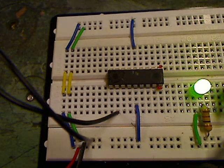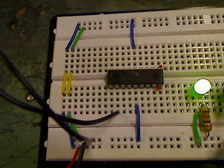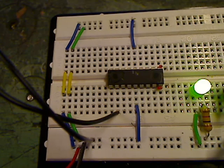Now the third one is a little bit more complicated, because there are a couple of resistors involved. What the schematic is telling me is that this requires a 22K resistor, and then in between the two, a 10K resistor which runs to ground. I've got both of those resistors sitting here. The only pin we haven't done is serial in, which leads to the B connector — the middle connector, the one wire we have left.